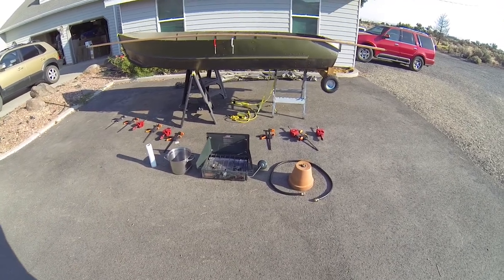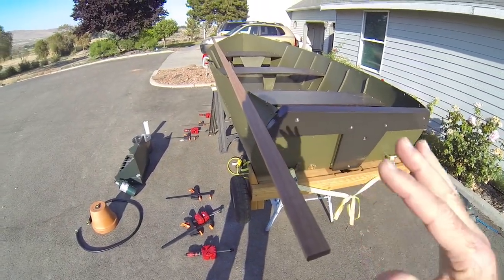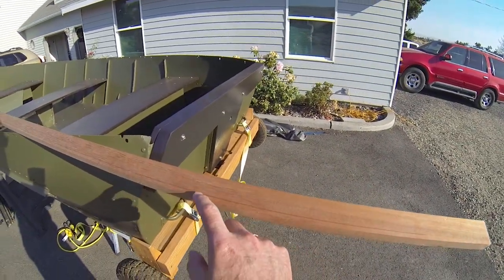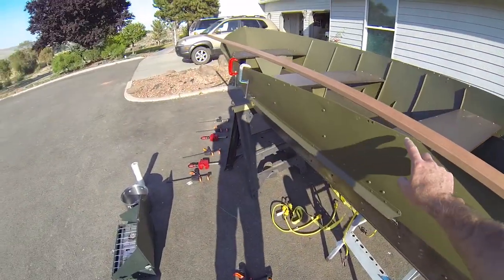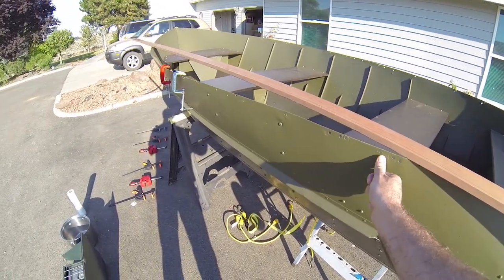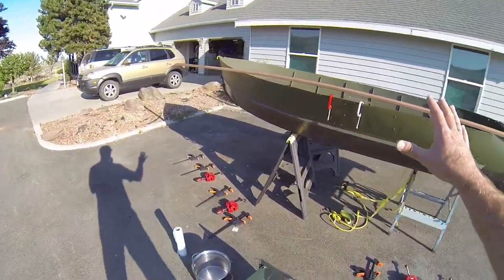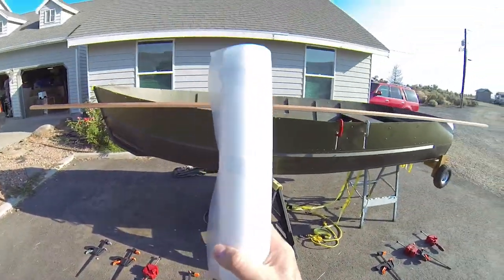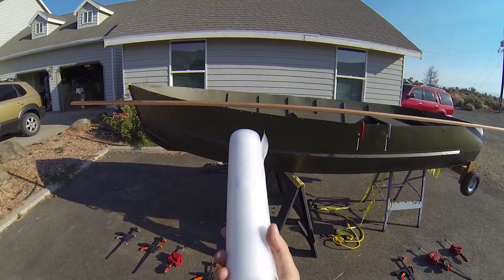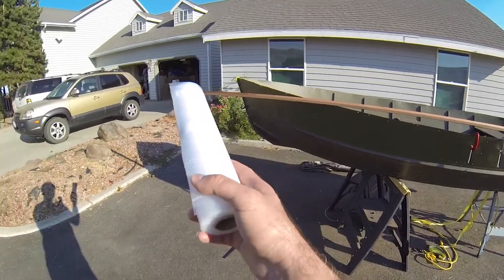We've got the piece of mahogany — it's 14 feet long for a 12-foot boat, and it's gonna bend so I'm not sure how much that'll use up. We've got a quarter-inch mark along the board, and that mark is gonna go right at the top of the metal all the way around — a little bit above the metal but enough wood below to put some decent screws in and make it solid. The bag it's gonna be steamed in is a roll of food saver vacuum bag. This stuff is high-temperature plastic designed to be boiled in water, so it should be resistant enough to the heat.